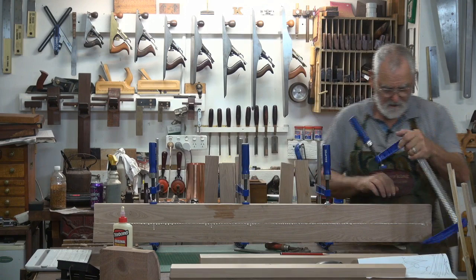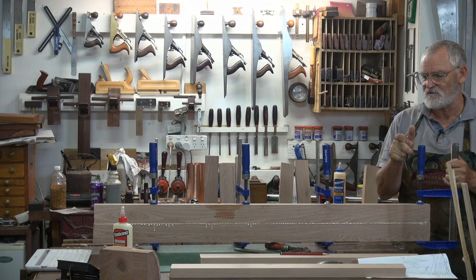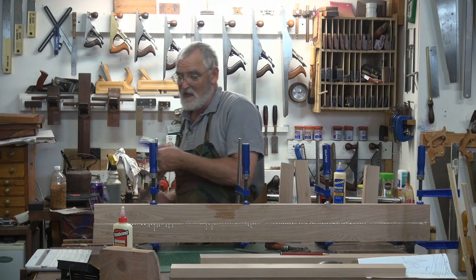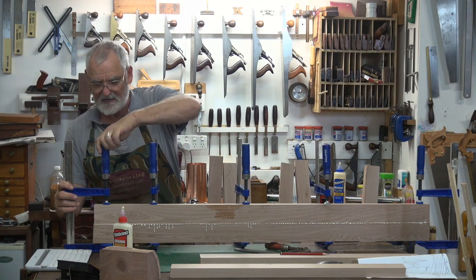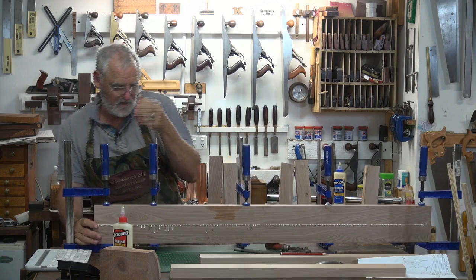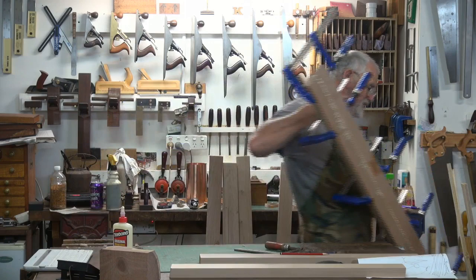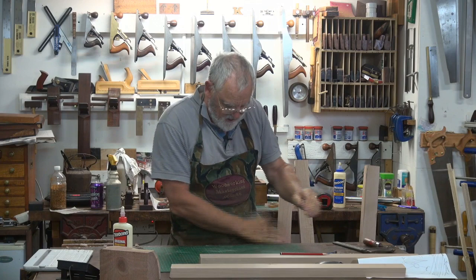And the lathe I've got is a Record Coronet Herald. It's lovely. The other one I've got down here in this shed, which I use for furniture work, is huge. It's a big clunker. One person cannot move it. But it's got 1800 between centres. So when I'm doing legs or spindles, you could almost do a newel post on it if you wanted to. It's really good. But this new one is brilliant. Electronic variable speed, reverse. It's nice and quiet. Well, this other thing I've got is just a belt drive with a gearbox, and it's noisy and clunky. But I've had it for a long time, and it has served me well. I've done a lot of work with it.